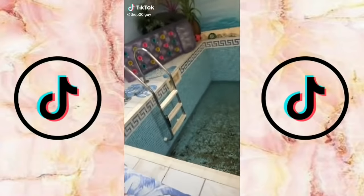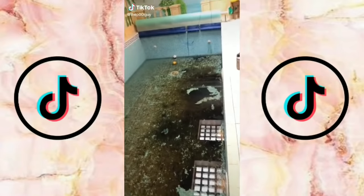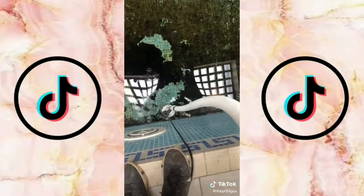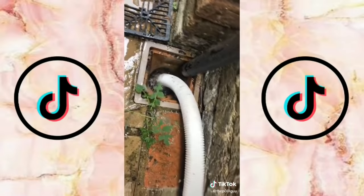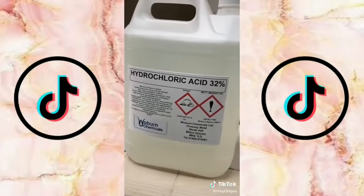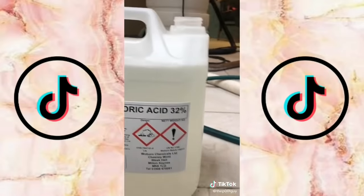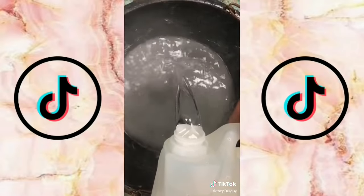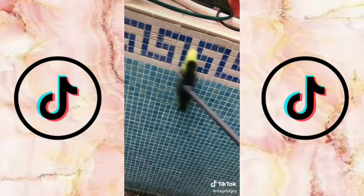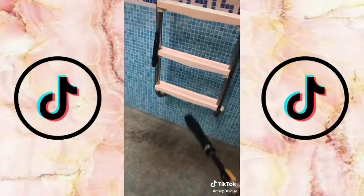Come to this indoor job today — it's already nearly empty, it's been sitting for a while so it's got quite dirty on the bottom. They want it fully emptied and acid washed. Stick the pump in, get my wellies on, fill a bucket, get some hydrochloric acid out. Get the brush and start brushing all the walls down.